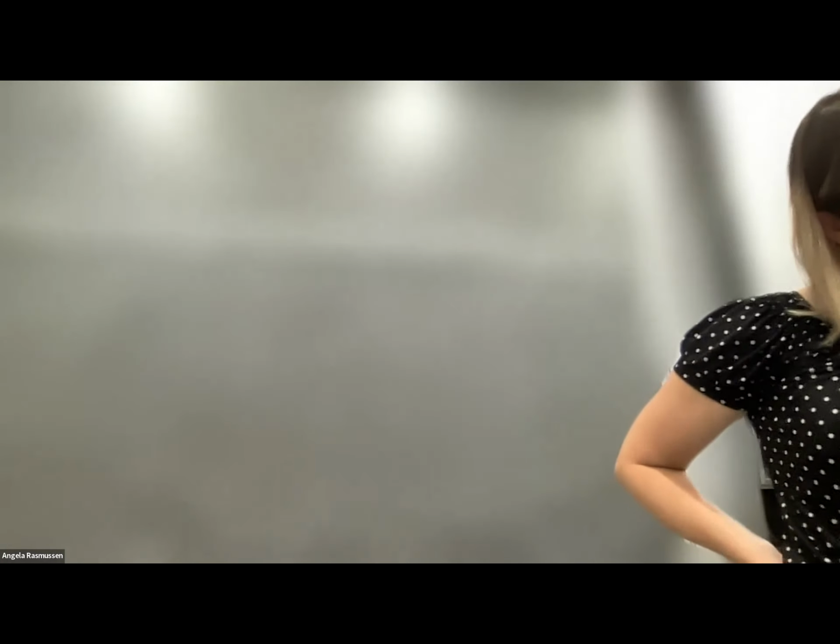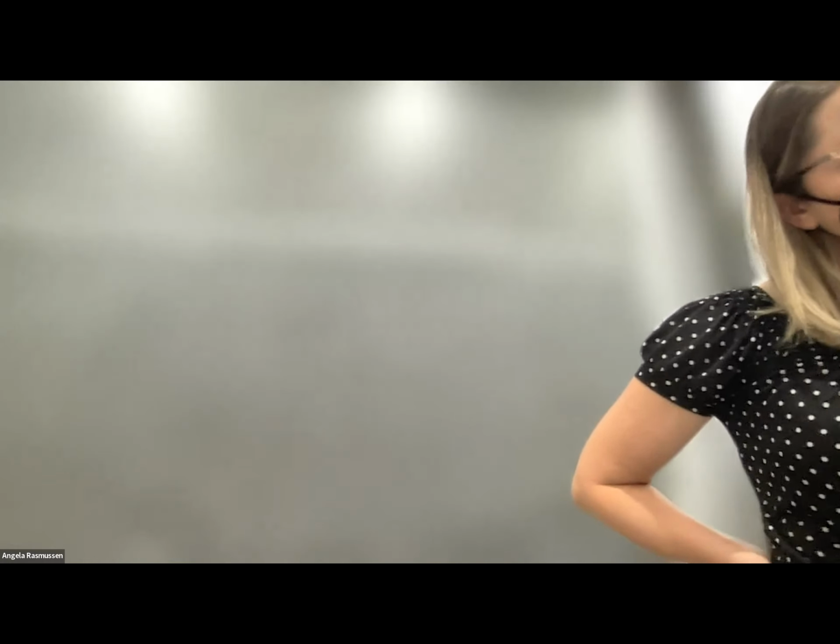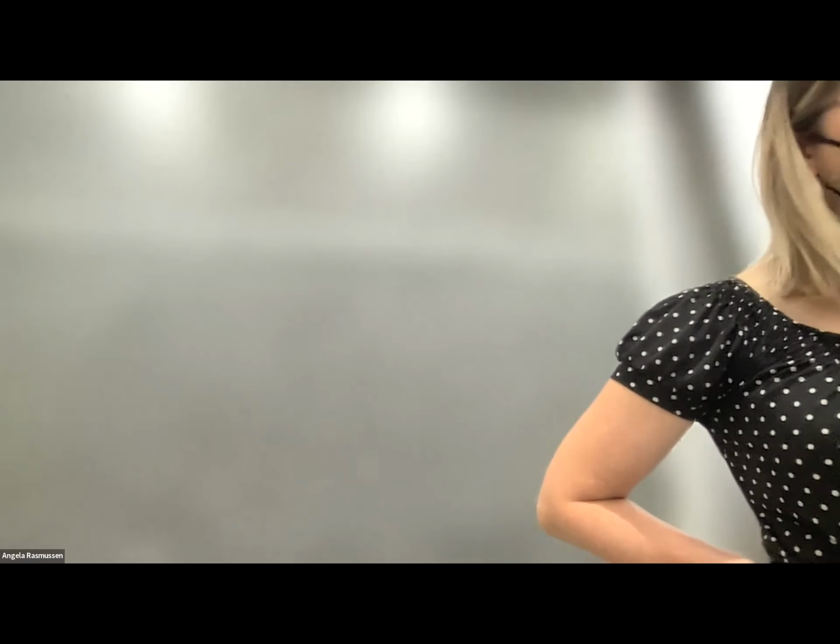So when we're doing this part here, is this 0 plus or is that infinity? The only thing we need is the initial conditions, and that we get from the 0 minus. Okay. And that's because the 0 minus is the same as 0 plus. Oh, so that's where the initial conditions are gonna stay the same. So we're just looking at VL and IL. Or VC and IL.